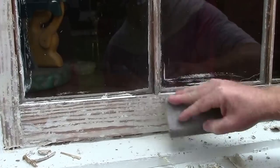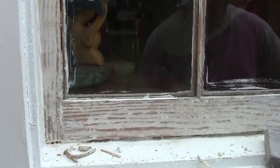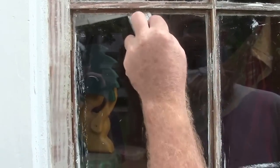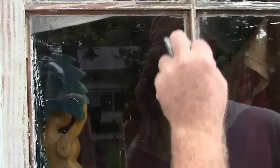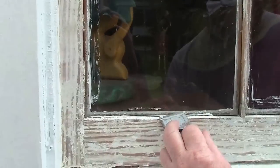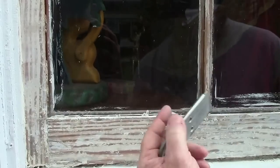That gets it all prepared for priming. I'm going to have to replace this pane right here. For this one I don't have to — you can see there's paint on the glass, so all I do is take my razor and clean it up at an angle. It doesn't take a whole lot of pressure, but you have to be careful depending on how the window was put in. If you put too much pressure on it, it may break the window. The glass is secured by glazing points — there's one there, one there, one there, and there's supposed to be one at the top but I don't see one.